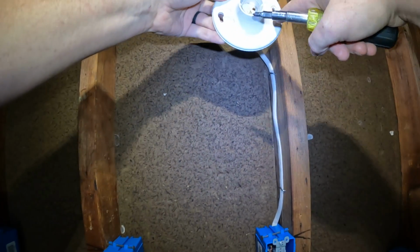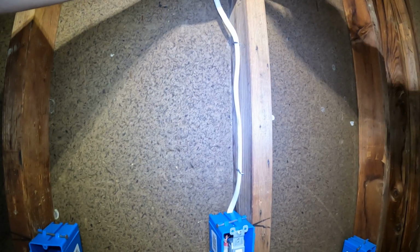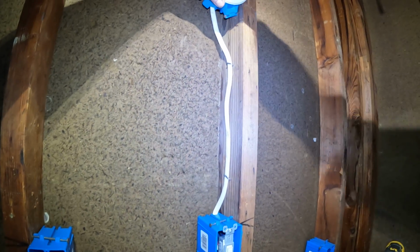This fixture happens to have two slip screws. Now this will come with a machine thread screw, but in the garage testing with my son, we use drywall screws. Don't do that in real situations. But for here, for convenience, this works best for us. So there we go. There's our light. Now, let's screw a light bulb into it. And let's see if the magic works.